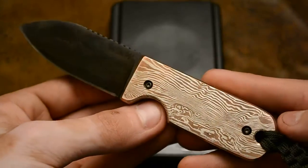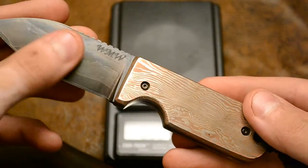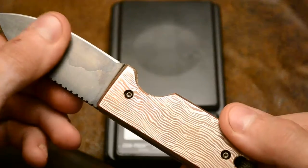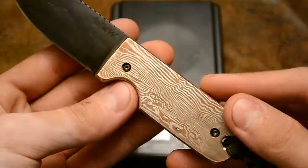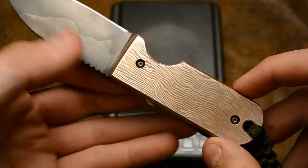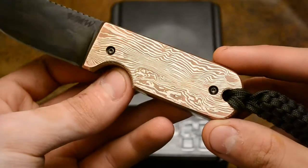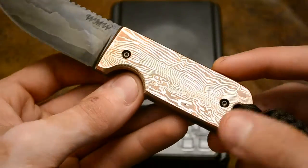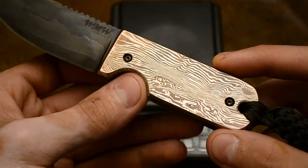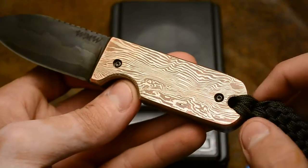But it's just a testament of my abilities up to this date — being able to forge weld together different layers of steel, and being able to forge weld copper and nickel together, which is actually quite a bit harder. Because these guys will melt a lot faster than the steel will. So it's a lot harder to work with, because you have to anneal it every couple of heats because it work hardens — copper and nickel. And that takes more time since you have to wait to heat it back up and watch it more carefully to make sure it doesn't melt.